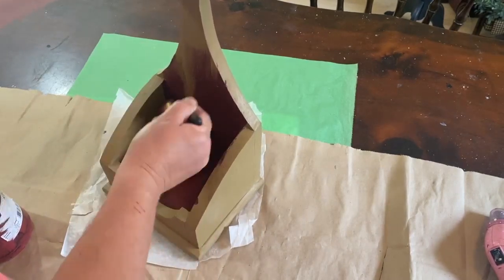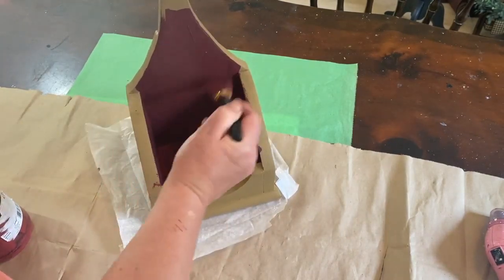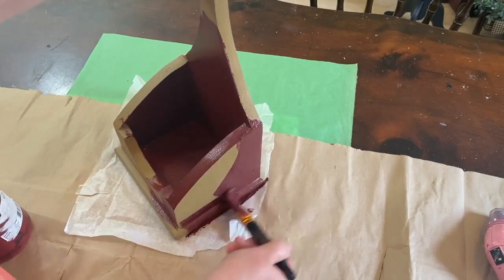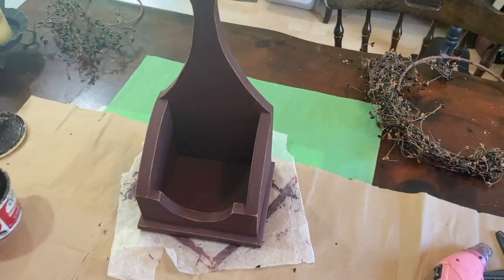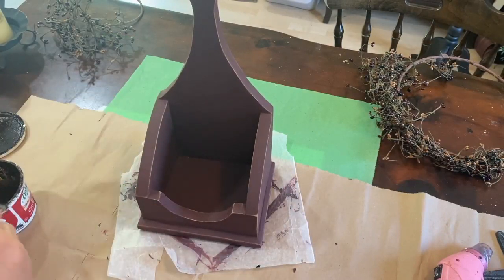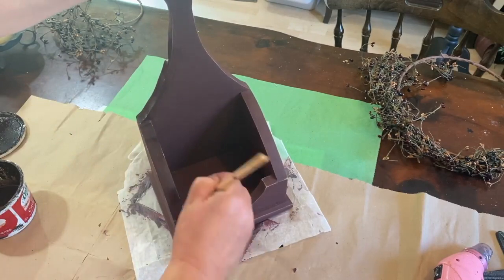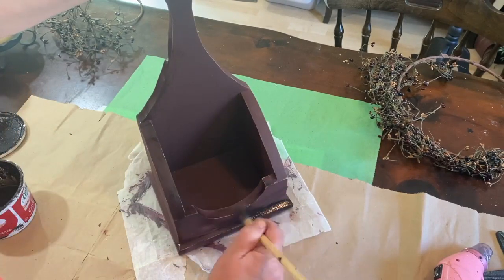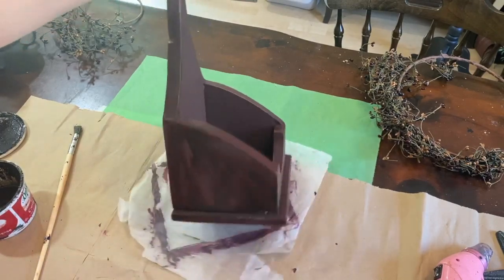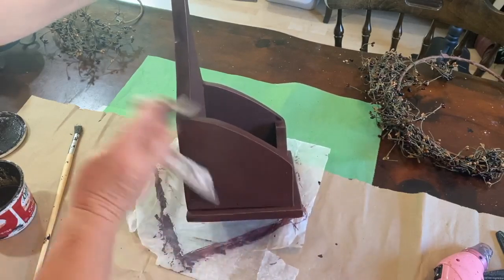I really like the mustard color that's on it, but it's very dirty and there was a lot of spots where it wasn't all the way covered. So I decided to just give it a nice burgundy color all around. Once this dries it gets a lot darker, and I went ahead with some sandpaper and distressed the edges just a little bit. Now I'm giving it a coat of my dark wax — made with a little bit of black paint — to give it a darker, more distressed look and also to seal it up. I put it on with a brush, then wipe it back gently, leaving some down in the cracks around the edges.